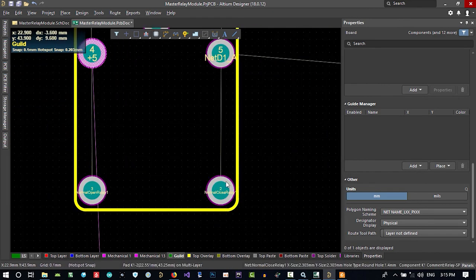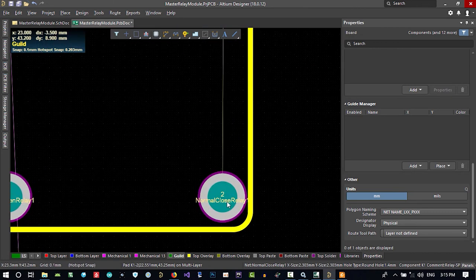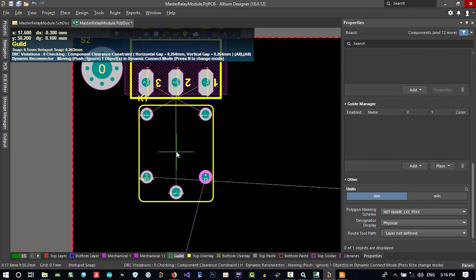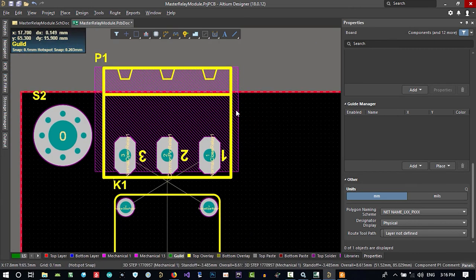And you see, this and this are the two pins that will draw a lot of current. So we should just change its position. You see, from this it goes to here and this goes to here. We can just rotate this in our schematic, so it will be okay, because there is no standard way to do this. So you can just rotate this. Let's go and find out.